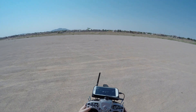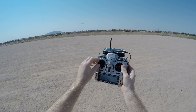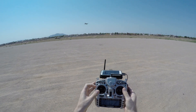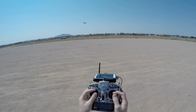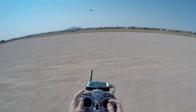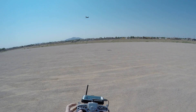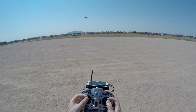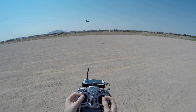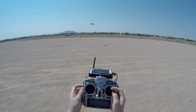In position flight mode, just put the stick roughly in the middle and it will hold its position. If you go to altitude control, it keeps its altitude but you have to work to keep the aircraft in the same spot. In manual mode, you're completely on your own — the aircraft is not helping at all, other than the multicopter stabilizing itself. So I prefer position control.